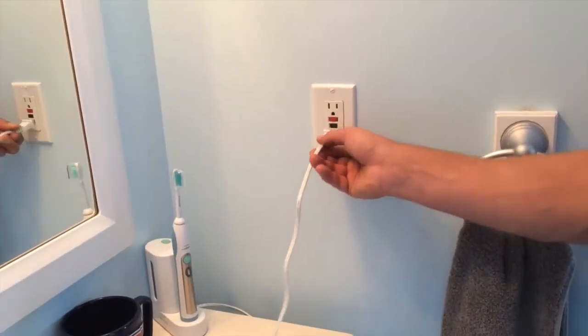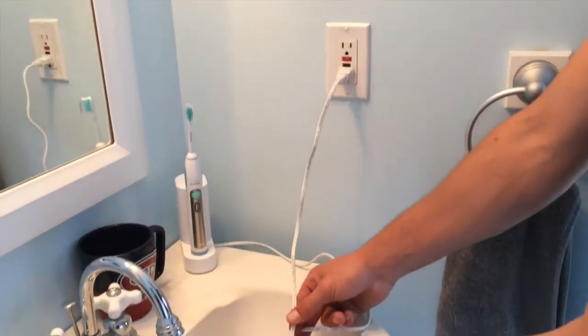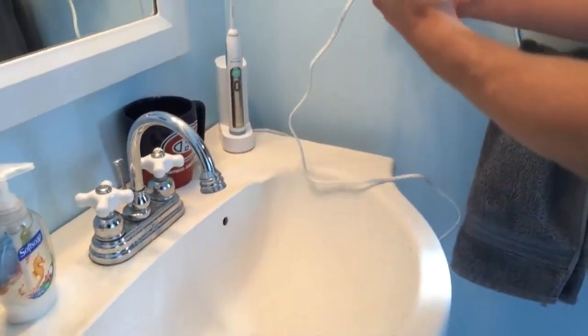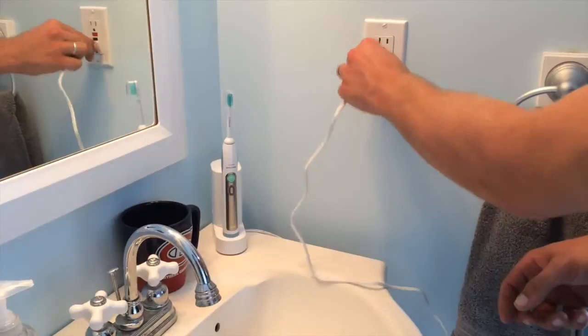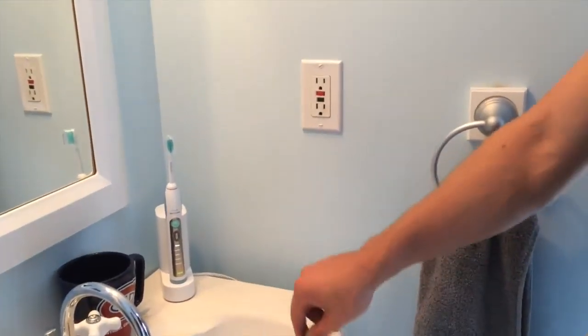This is essentially for situations where there is a cord near the sink and it might be a little bit gashed. If you're washing your hands in there, it could actually shock you. So the GFI will read a 5mA current between the hot and neutral and it will shut off — protecting any plugs on the load side running out of that receptacle.